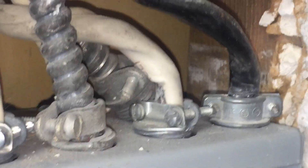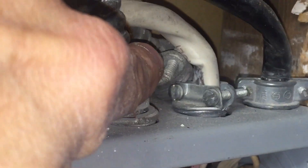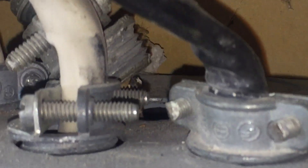Hello and welcome to Moving Violations. Take a look in the back here at this armored cable you see kind of dangling out of the panel there. Coming around this side you can see it's not even in the enclosure. There's no lock nut, it's hanging out. Look at that — the conductors are exposed to those sharp edges looking on the inside. You can see the opening is not closed up. We have several violations.